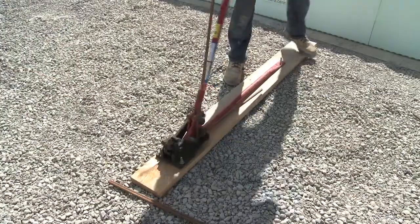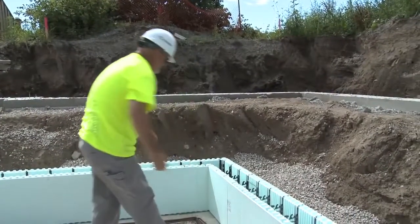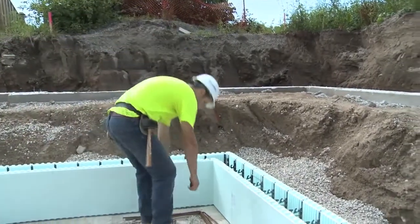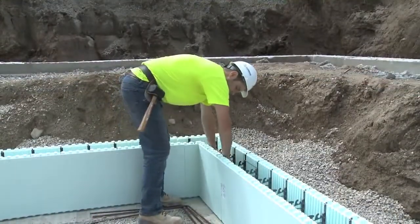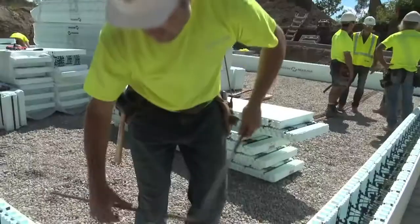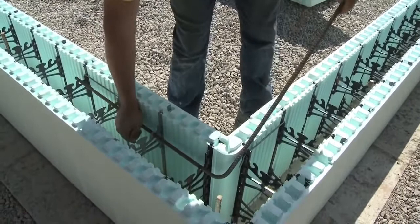Nudura recommends that you cut 5-foot or 1.5 meter lengths of rebar and bend them 90 degrees and have them placed at the corners. This will save time during the installation process. When you get within 1 rebar length of the corner, install one of the pre-cut 90-degree sections of rebar. Cut the previous straight section to achieve the necessary overlap and fit it into place.